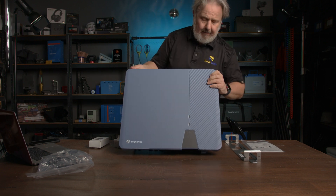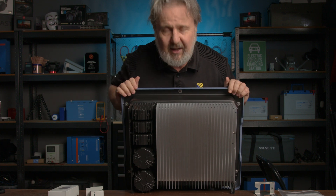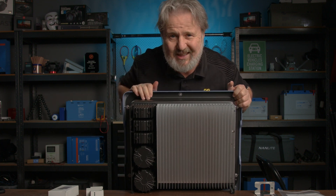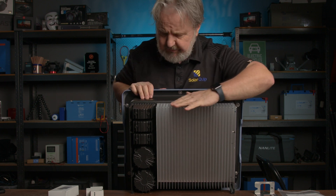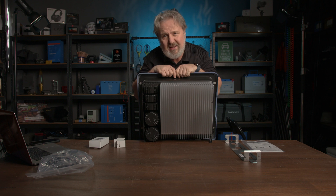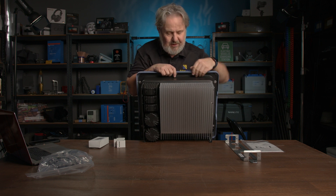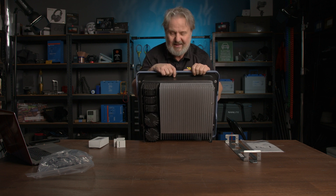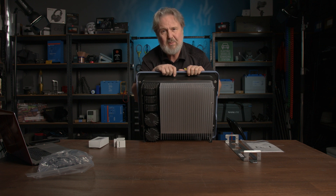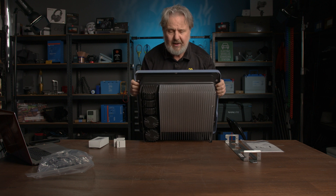Let's have a look at the back — really the top — and the heat sink on this unit. Carefully done, passively cooled, so no fans on the outside, which is why it's IP66. It doesn't require any internal cooling, so there's a lot of heat sink, and probably chokes down here too. It's worth noting the manufacturer will specify clearances for installing from other surfaces and adjacent equipment. This heat sink vents vertically, so it needs space above and below for convection to work well, and equally either side for heat dissipation. Make sure you comply with the manufacturer's clearance requirements.